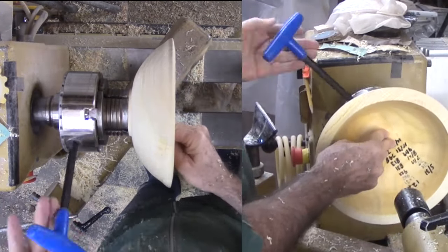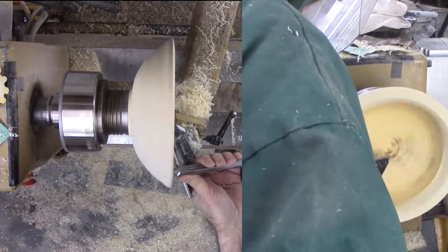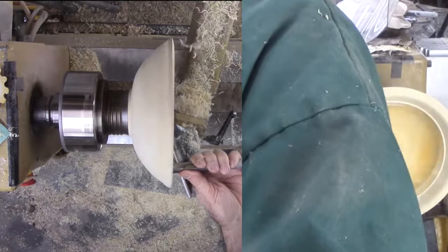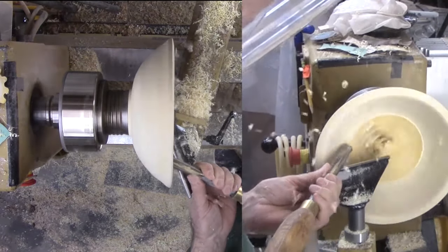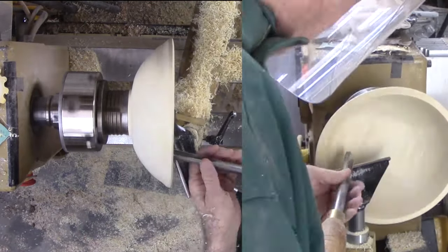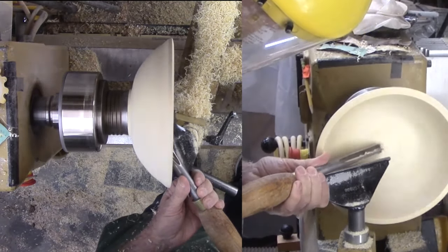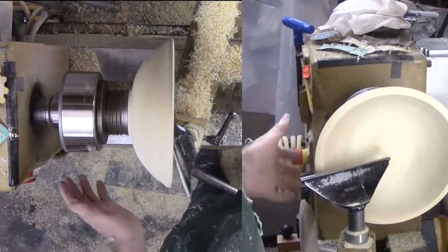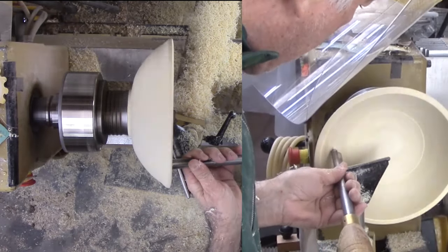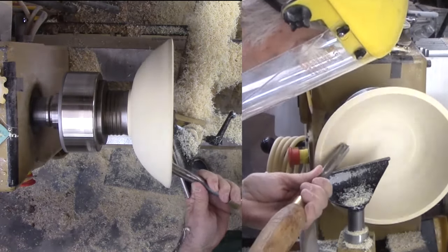Reversal time again using the newly trimmed tenon. It is time to refine the hollow and take out the warp difference. An intermittent cut on the inside is a bit dicey — I cannot ride the bevel. But after a couple more cuts, I am again on solid wood where I can work on uniform wall thickness. I stop a couple of times to measure, as I seem to often have a thicker bottom until I measure. I guess it is due to my primal fear of funnels. I finish up with a heavy bowl scraper, staying away from the more vertical sides. A small round scraper does a better job on the vertical sections due to its smaller cutting edge.